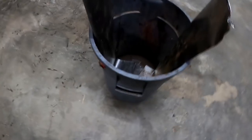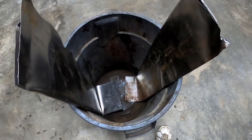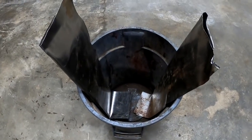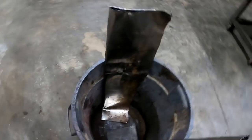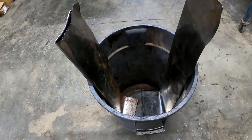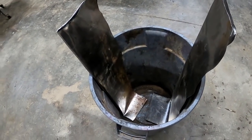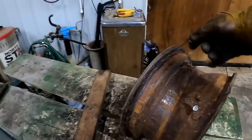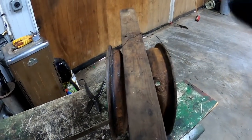I had to fold my sheet metal a little bit to make it fit in the barrel — it's just leftover sheet metal from a project my brother had. I like to have a little bit going across the bottom; it's a line-of-sight thing — the more directions you can get your sacrificial metal coming from, the better it's going to do. I've got my wheel set up with a piece of mechanic's wire to hold it in place, and I'm going to balance it with this 2x4.